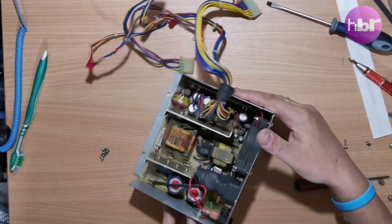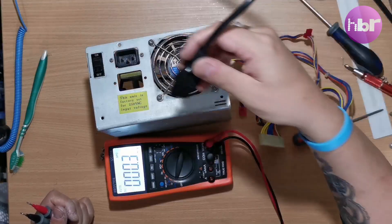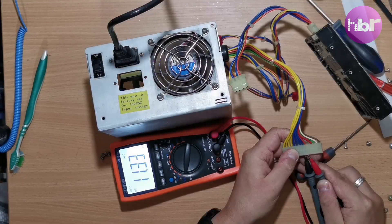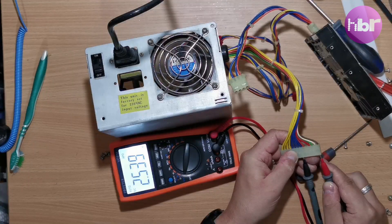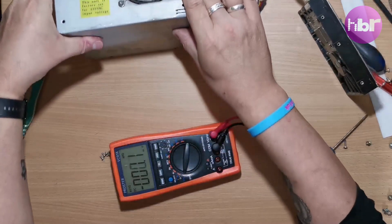For now I'm not planning on doing anything other than testing that the voltage outputs are as expected. We've got 11V, minus 11V — those are the 12V lines — minus 5V. The 2.5V fluctuating is the tick signal, and everything else is 5V. Everything looks good.